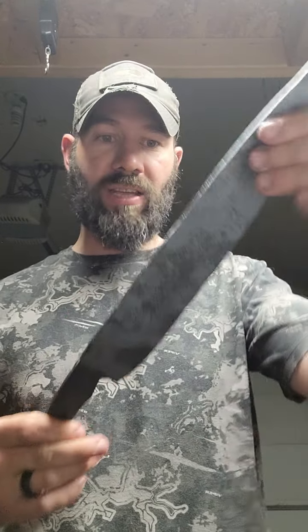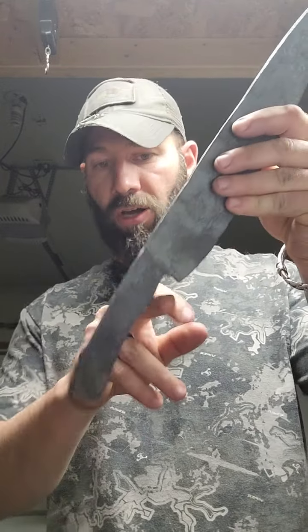So you can see the thickness of the spine versus the edge, right? You can see that taper. You can see the bevel. That was all done on the anvil. The finger choils are done on the anvil. And that's what I mean by where to hit, how to hit in different parts of the anvil. And that goes to what I would consider, this is probably about 87% done on the anvil, as far as